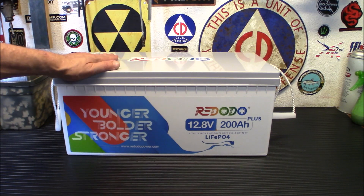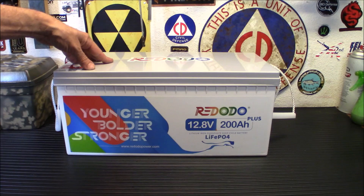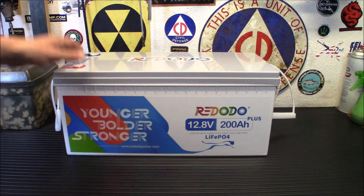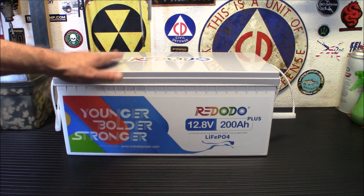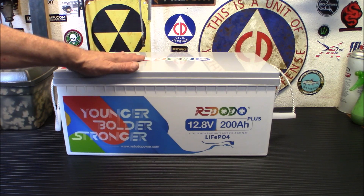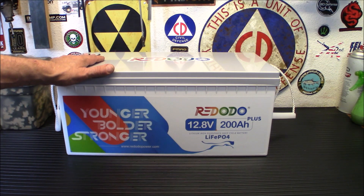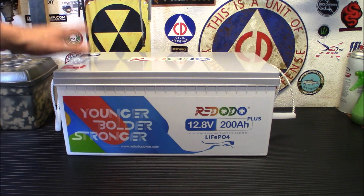We are going to install it, so don't worry — we'll be putting this in the system, and that will be a far more interesting video. I know folks are thinking about all the warnings about how the grid could fail. Now is the time — you can get a couple hundred-watt panels, stick them outside your house, a decent charge controller designed for lithium iron phosphate, one of these batteries, and a good inverter, and you're good to go. You don't need a whole-house system for backup power. This is going to be a long-term, well-designed backup power system for me — kept in my garage, set up on a rack, ready for emergencies.